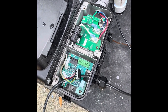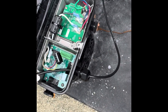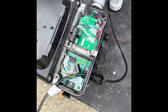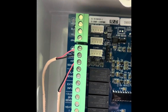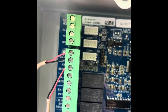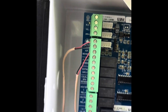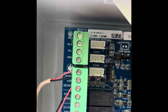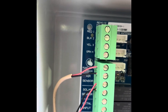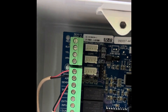What we're going to do is hook up our black wire right there. It's going to hook into terminal 2 at the pump, and it's going to hook into terminal 2 on the ProLogic — you just want to match those up. And vice versa, we're going to put the other wire in terminal 3, which is B, going into terminal 3 up here. Then our ground wire is going to go into terminal 4.